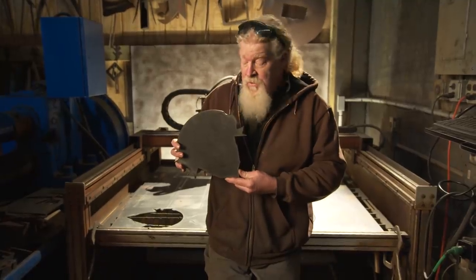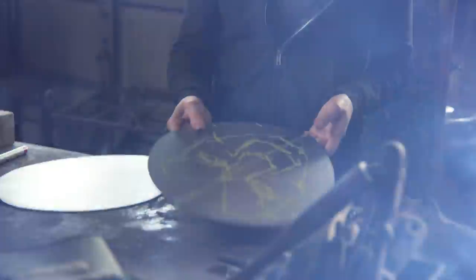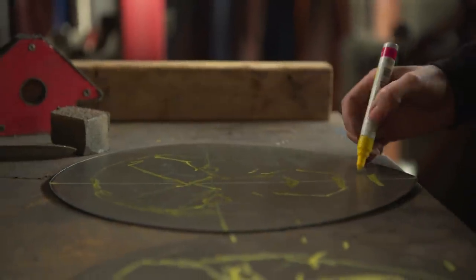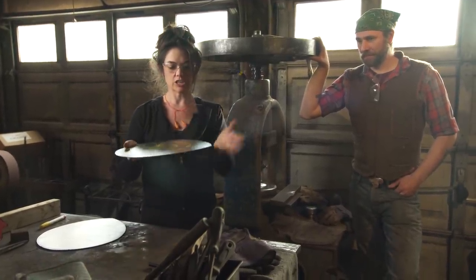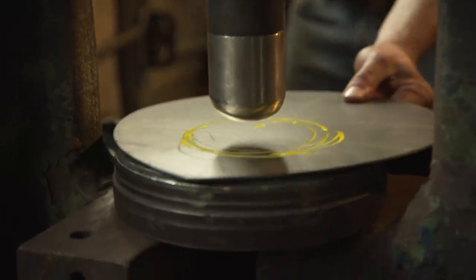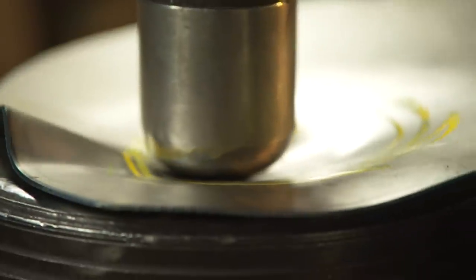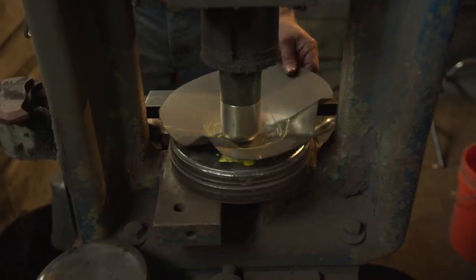We're going to build the blades around the outside of that structure, and there are big spikes up on the ends. As soon as we have these plates laid out, you'll see what the entire piece is going to look like. I've sketched out the lion's head on this piece of sheet metal — we need to make two. Derek and I will be forming these into lion's heads, starting with the press to begin dishing out the shape. The depth has to be about six inches tall, so it's going to be a lot of forging and chasing repoussé work on these sheets to get them to look like lion's heads, going back and forth between different techniques to get the volume we need.